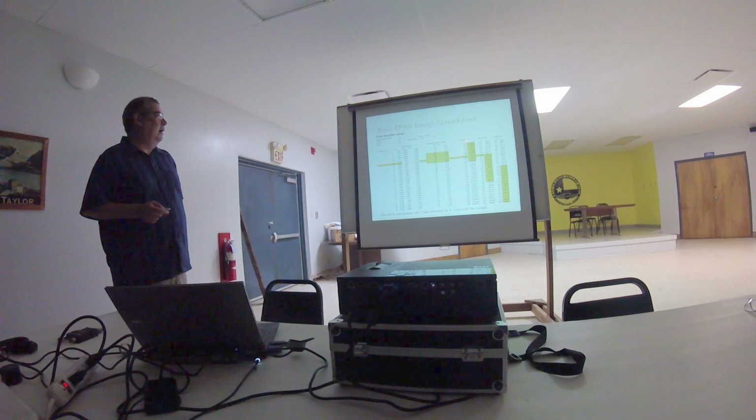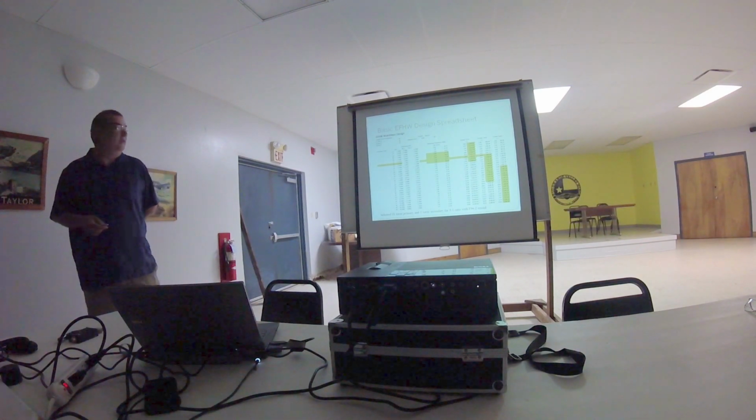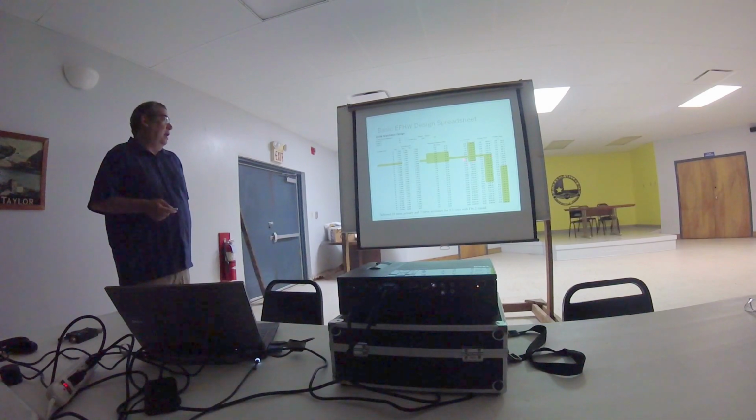So then here, I'm looking at different options for the primary turns. If I do 2 primary turns with 18 secondaries, I end up with a 9-to-1 transformer ratio, which tells me the impedance at the terminal should be about 4 k ohms. So that's what I settled on. Essentially, this is where I figured I'd get the best range out of that cap. I'm using this Amidon T94-2 with 18 turns of wire as a secondary, and then 2 turns as a primary.